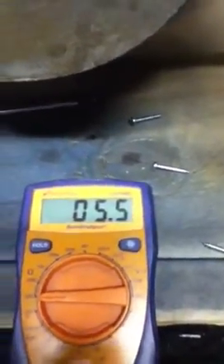This other speaker says 8 ohms, but when we actually meter it out — positive — when we actually meter out an 8 ohm speaker, it's giving us 5.5. The fact that these speakers actually have less resistance than what they either say or what we thought means you need to wire them in a way where they're going to be stable on your amp.